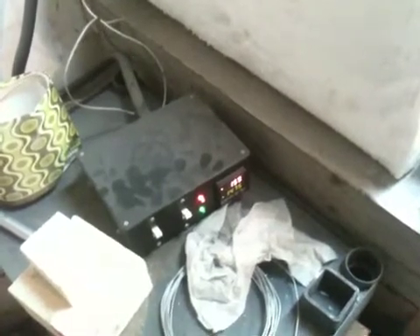As you can see, it's already heating up pretty fast — we're at about 156 to 163 right now. I can already feel the heat from here. Those elements will start glowing pretty bright fairly soon. And inside I just have a cut-off from a fire brick that I use to elevate my knives when I'm heat treating.